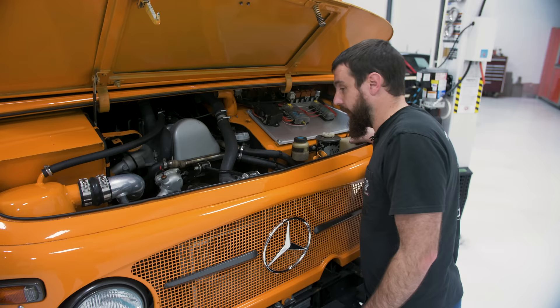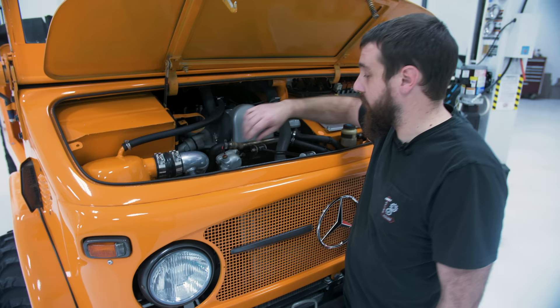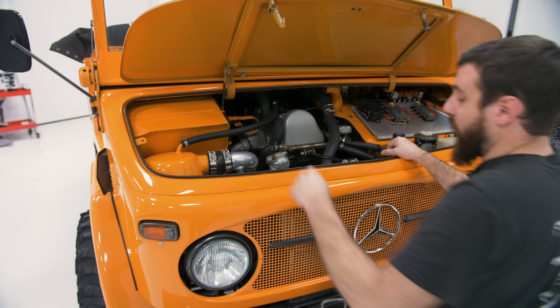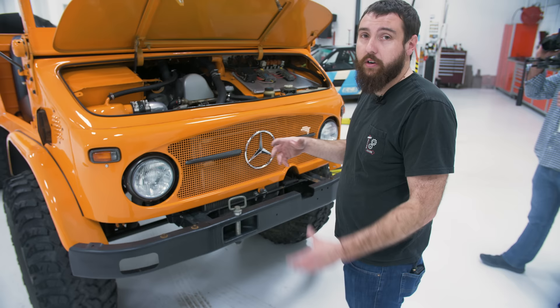Down here is a York air compressor — it's basically the AC compressor out of anything from the 60s to early 80s. Mine's actually out of my old Audi. These are an oiled AC compressor, so they can't run dry on oil — it's not like modern stuff that uses refrigerant as the oil. So you can run these and just compress air without them grenading.